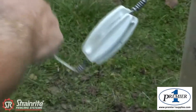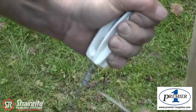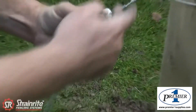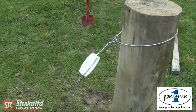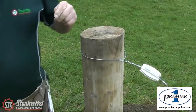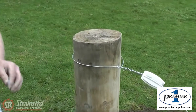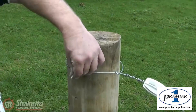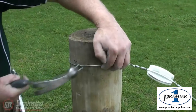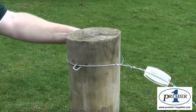If the crank is getting a bit short, just extend it. That way it pulls off the middle of the insulator — if they're both pulling off the centre, it's not twisting the insulator. Mark the gauge on the post: normally for plain wires you'd come down 50, but because we're putting insulators on here with a hot wire on the top, we come down 75 — that leaves room from the top of your post to fit your post insulators on. Just put a skewer staple in there to hold it and check the wires are level coming around the post.